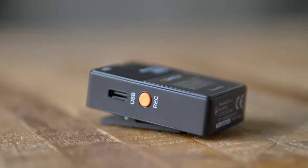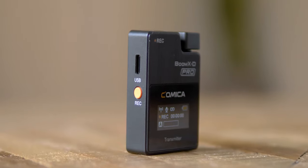You can get about 24 hours on that 8 gigabytes before it starts to overwrite previous recordings. Note that you can't access those recordings through the device menu — you have to use a computer. But you can basically get a full 8 to 12-hour shooting day without worrying about overwriting files. Internal recording is so important because if you want to go up to 100 meters you run the risk of dropouts, and with internal recording you can always recover them.